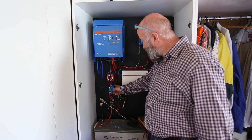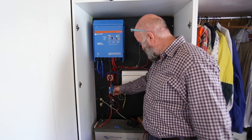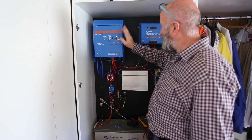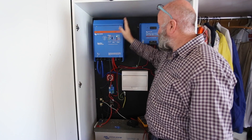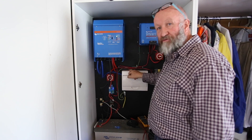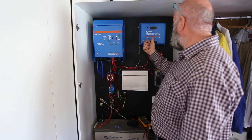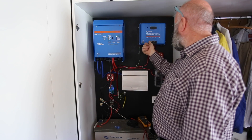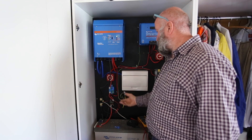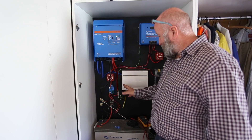The next thing is this smart battery protector from Victron - it's blue, so it's a Victron. It replicates what's inside the inverter-charger. There's a low-battery alarm inside the inverter that will switch the 240-volt inverter side off. But the smart battery protector switches the whole system off, including the 12-volt side. That's essential when you're trying to protect batteries - you don't want to run them right down.